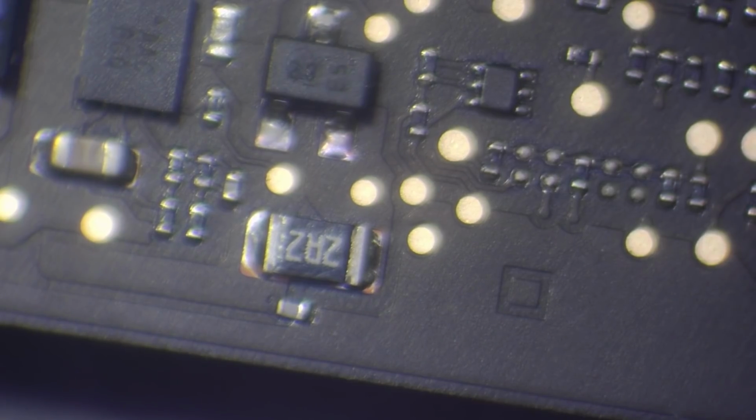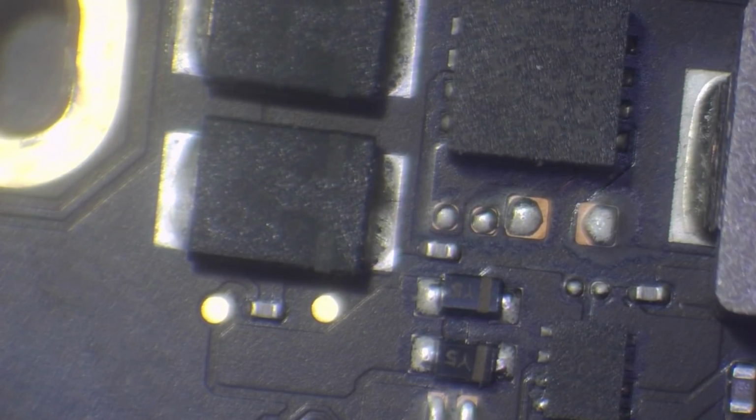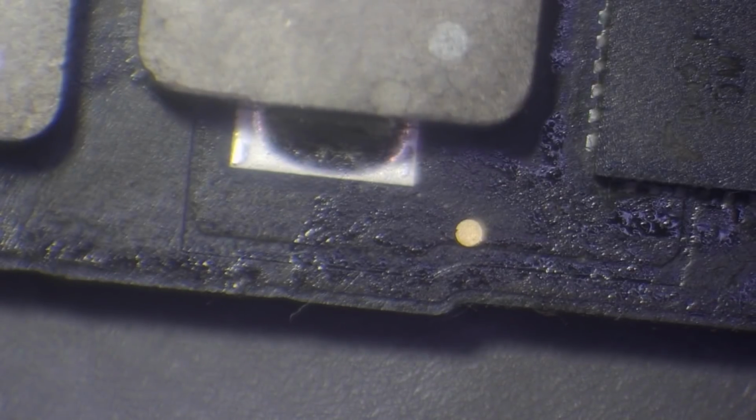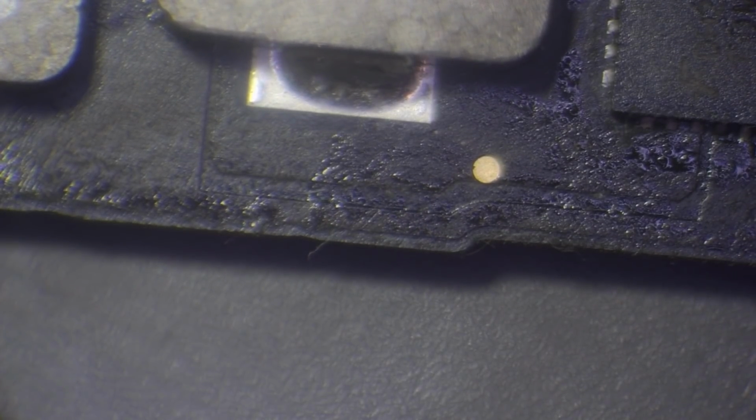Alright, so I'm going to check PP bus G3 hot for resistance to CPU V-core. I'm going to try and locate it. Alright, so we've got a cap here which is supposed to have G3 hot on it. Resistance to ground is in the 300,000 ohm range. So I'm going to keep that there, and I'm going to check against these coils around here. We're in the millions of ohms. I don't think this is an issue. So something's not turning on. I don't think it's anything on the CPU.